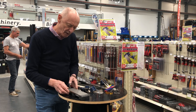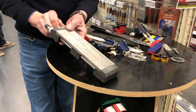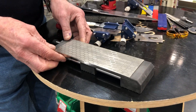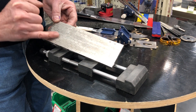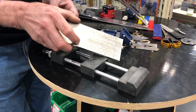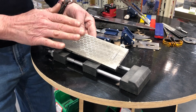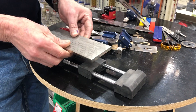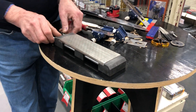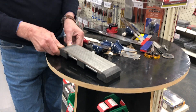Another reason why these are versatile is you can undo the bench pad that holds it firmly for you. On one side we have a thousand grit diamond powder and on the other side we have 400 grit, so you would start your sharpening on this side of the pad, then flip it over, put it into the bench holder, tighten these knobs here, and away you go.